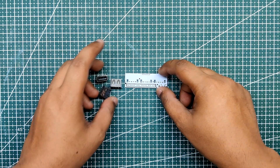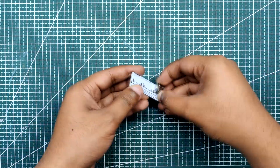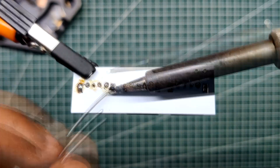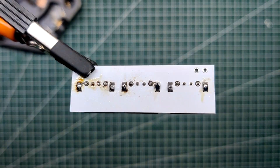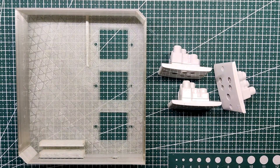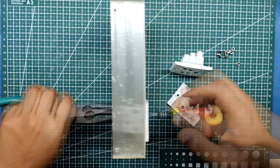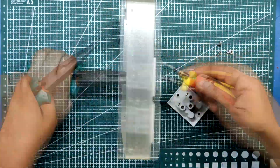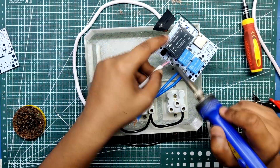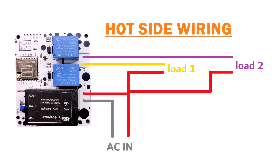The USB board was quite easy to put together — only three USB sockets needed to be attached to their PCB pads and soldered in place using a soldering iron. Using M3 nuts and bolts, we first added the AC sockets to their positions on the 3D printed body to begin the assembly process. The AC wires were then connected to the relay and socket using the accompanying wiring diagram.